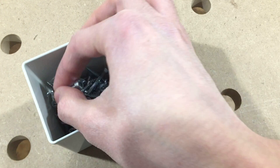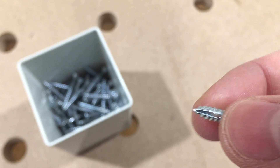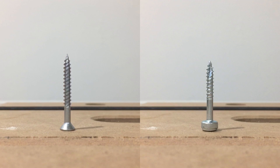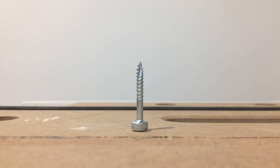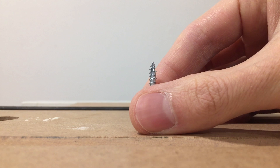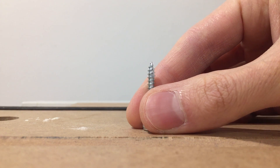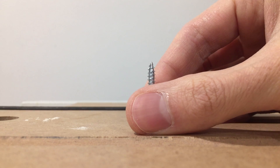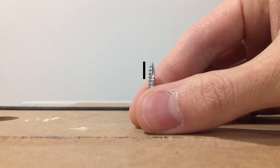The other day I was looking at some screws — specifically, this self-tapping screw. The difference between an ordinary screw and a self-tapping screw is in the tip. The self-tapping kind has a fluted design that's there to cut out some material and allow starting the screw with less effort. Studying the machine marks, it looks as though it's made by a grinding wheel notching out one corner — a dead giveaway once you observe that one side is flat and the other is round.